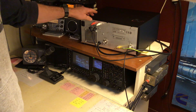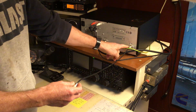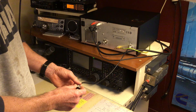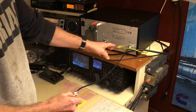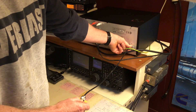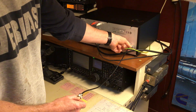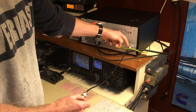Now for the coax input — I use RG58 to go into mine. I used to use RG213, but I moved the amplifier once, only very slightly, and all of a sudden I started getting interference on my radio. I thought what's going on? What have I done differently? I must have moved it slightly and it didn't quite make 100% contact. So if you get one of these amplifiers and you think it's creating interference, start looking there — make sure those connectors, especially the earth side, are making 100% contact.